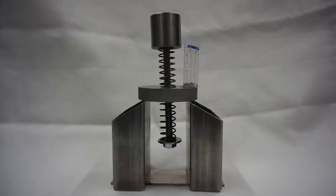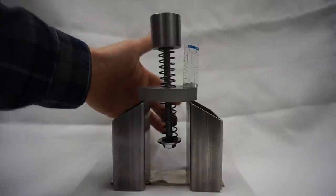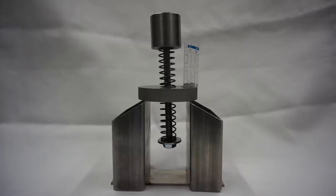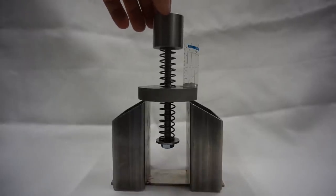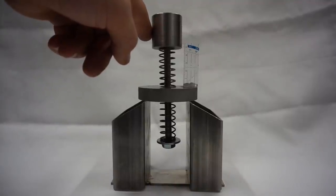So, first setup. We have a spindle with no preload. You can see this because the lower spring is completely free and has no preload. So this is similar to a locating, non-locating bearing arrangement with the upper spring or the upper bearing as the locating one. Now let's keep in mind the initial chuck position, which is at roughly 48 millimeters, I'd say.